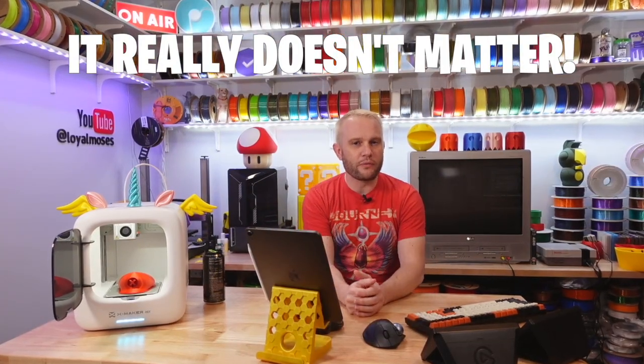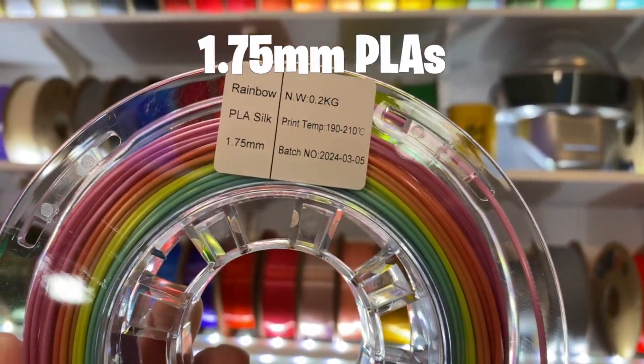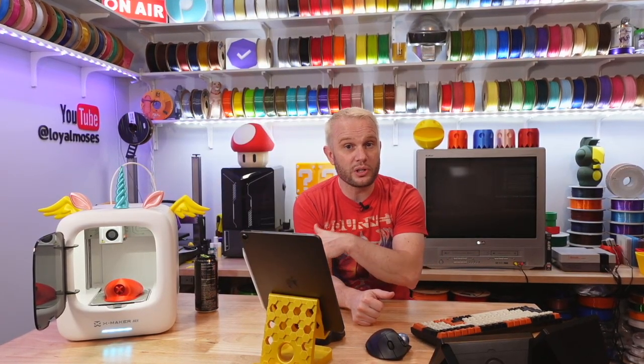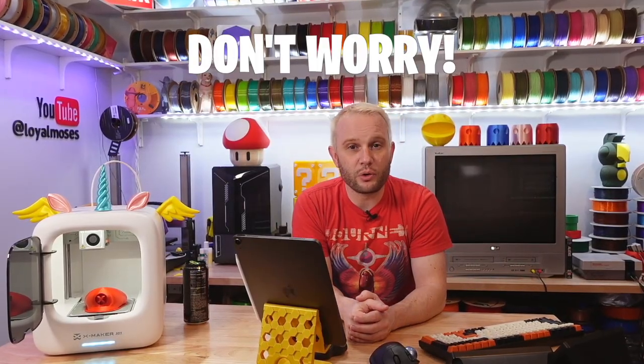As for maximum temperature, for this application where simplicity is the goal, it really doesn't matter much. But if you're shopping for filament, you'll be looking at 1.75mm PLA or modified PLAs like PLA+, HD PLA, PLA Pro, and Hyper PLA. It has a maximum temperature of 260°C where most PLAs print around 210–220°C, but all the models inside the Xmaker app will take care of those temperatures for you.